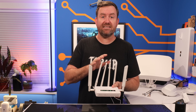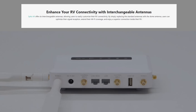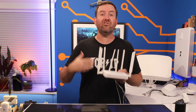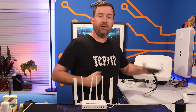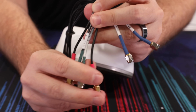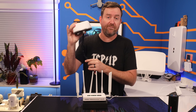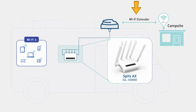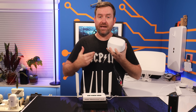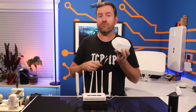The cool thing about these antennas is that they're flexible in their deployment — you can remove some or all of them. In an RV, the walls might be blocking signals, so you'd want to use an external antenna like this MobileMark on the roof for better reception. This particular model has four cables for cellular and two cables for Wi-Fi. When it comes to using an external antenna for Wi-Fi, you've got a choice: are you primarily picking up Wi-Fi as WAN from the exterior, or do you prefer Wi-Fi for internal client devices? In my case, I'm going to install this under the roof of my RV and only use the cellular cables.